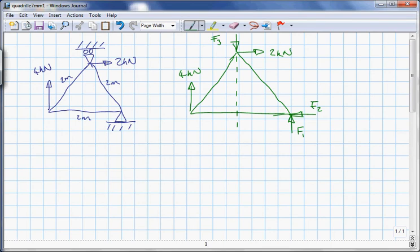Okay, I've just almost without thinking about it, I'm drawing in the line of action of F3 there. Never a bad thing to do, line of actions. Whenever you see the forces, what I would want you to do with a system like this is not see the structure at all, not think about internal forces in the structure, but just see 5 arrows acting on something. Doesn't matter what that something is, and they're in equilibrium with each other. So this ceases to be a structural engineering problem and it becomes a simple plane statics problem, to use the jargon. Okay, so how are we going to work out F1, F2 and F3?